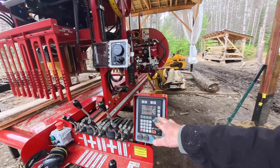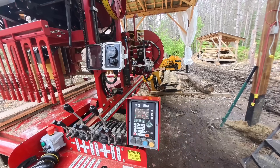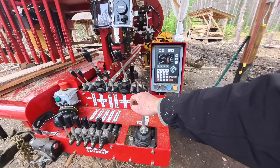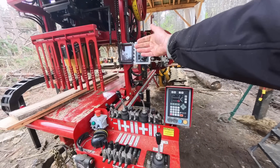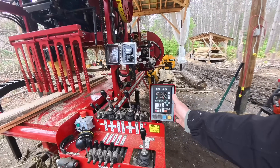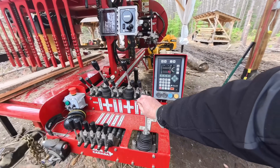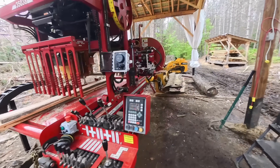In just a minute I'll fire things back up, press that button once the saw head is in place, and then type in inch and a half. That'll show in green numbers up here — inch and a half. Then how the process works with the sawmill fired up: I go down, make the cut, control it, stop it at any point. Once I'm done the cut, I bring it back — obviously bringing back whatever I cut — and get back to this position. The saw head is at the height I just made. All I have to do is press Enter and it's going to automatically drop it down inch and a half plus the thickness of the kerf. Down again and go — make the cut, bring it back, press Enter, it drops down, make the cut, bring it back, press Enter. So it's: down, back, Enter — down, back, Enter — and that'll go right down to the bottom of the cant.